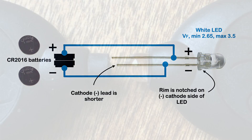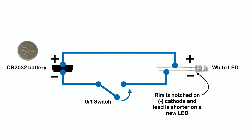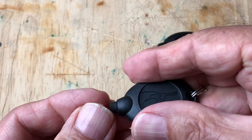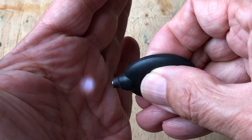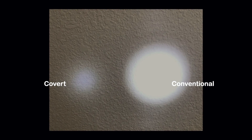How about a low luminance light that will run for many hours? A single CR2032 will not drive the white LED to the same brightness as two CR2016 cells. It has, however, a much greater energy storage capacity. Add a bit of heat shrink tubing to the LED, and you now have a very long-running covert light. For very little money, one can experiment, learn about LEDs, and make a very personalized key ring light.